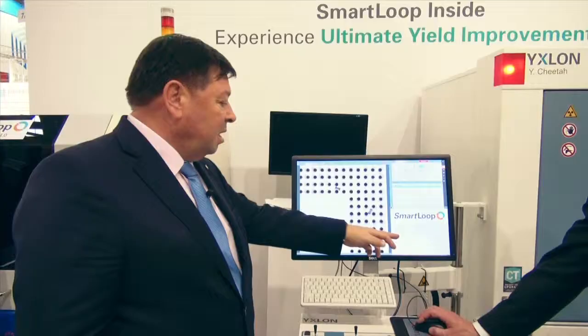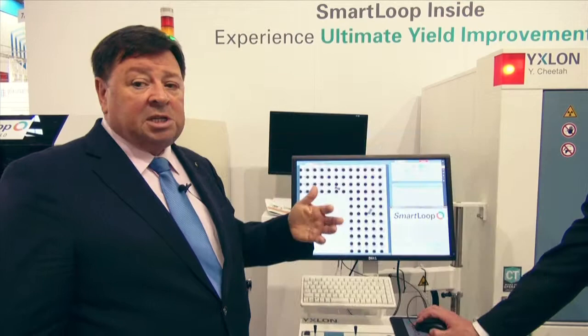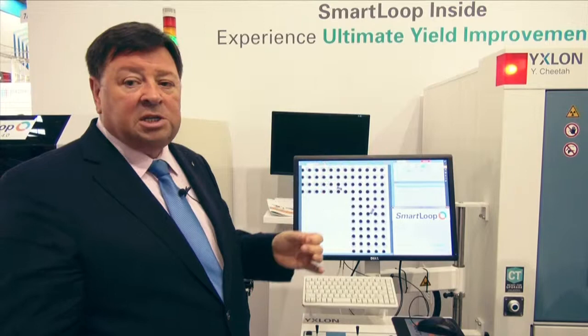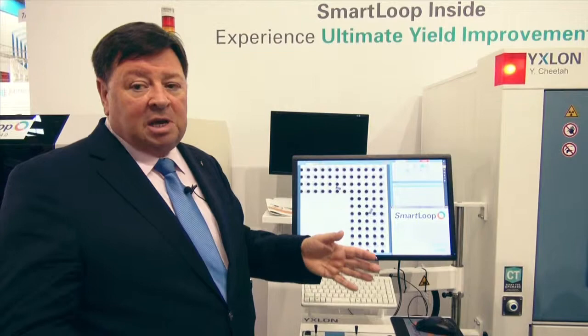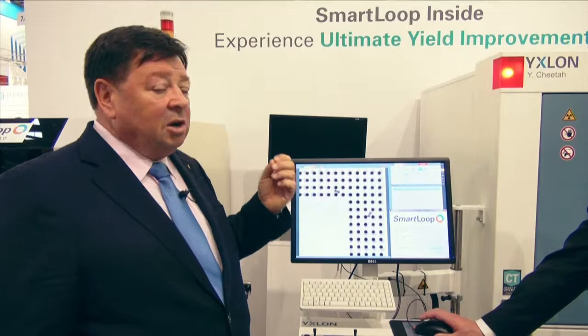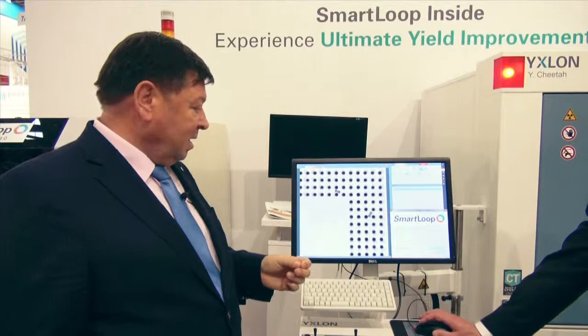We also have the ability to classify the fault, so that we can classify it as a failure because of an open, a short, what we have in this case, which is a chip under the component, or a whole list of other potential failures. So this information goes very accurately back into the factory management system, the SPC system, or whatever the customer is running. But as far as we're concerned, the important thing is we have looked under the component and found the reason for the suspect height, which again is the chip underneath the device.